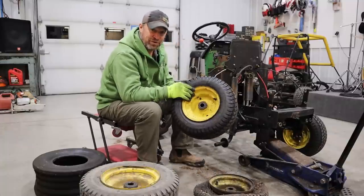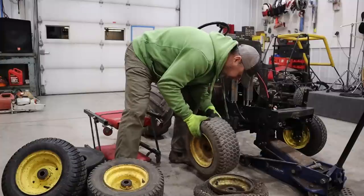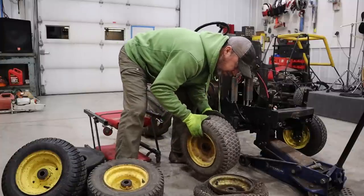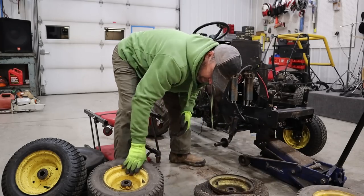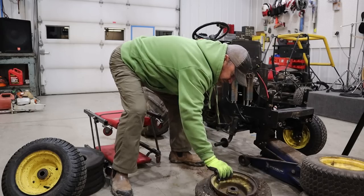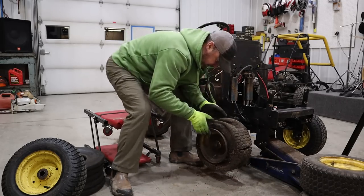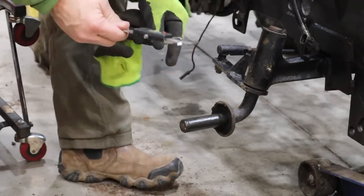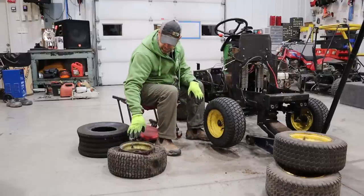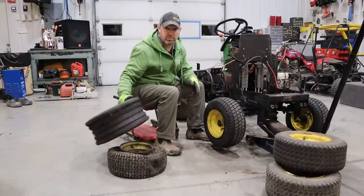There's just a snap ring holding the front wheels on these things. This is an older serial number tractor, so I'm guessing it's a 1-inch spindle. This smaller one does not fit on this spindle. These look like a match pair — so those don't fit. I do have this one from a tractor that burnt up, and I bet that'll fit. It does — that's the 1-inch for sure. I either need to get some different rims or see if I have two of the 1-inch rims. I wonder if I could put these Wetterstiens on those rims. I've got some research to do.